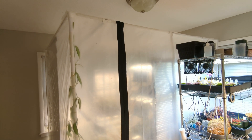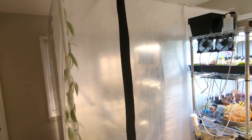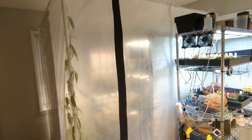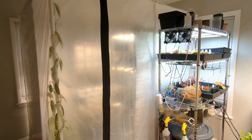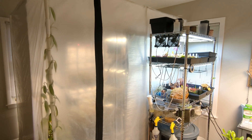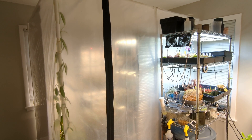In terms of the construction of this tent, I used half-inch PVC pipes like I did in my previous tent for the frame. I also repurposed snap clamps from my old tent to hold the plastic sheeting to the frame. The plastic sheeting keeps everything nice and rigid and gives good structure. I went with 3.5 mil poly sheeting for the tent walls. It comes on 25-foot rolls from Home Depot — I just bought some, cut them to size, and fitted them to the frame.